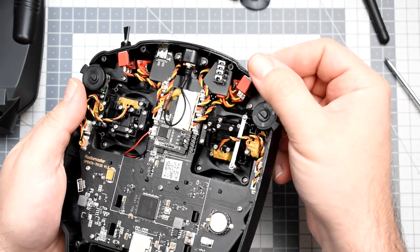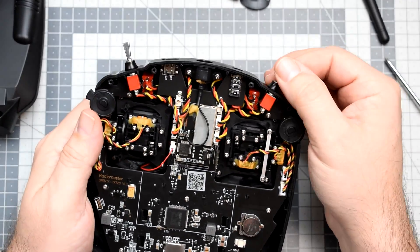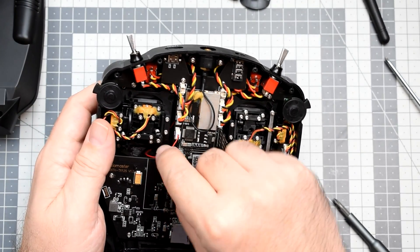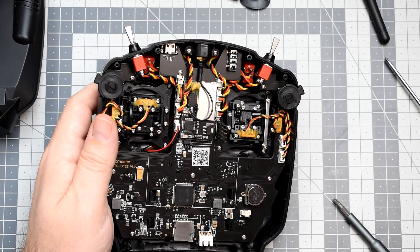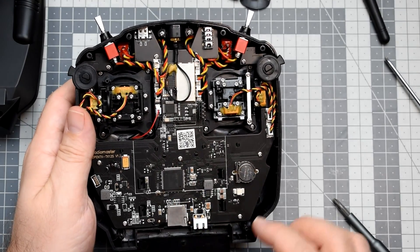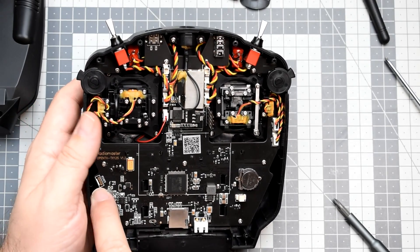The switches look fine — this really looks nice. There is nothing super wrong with them; they are held by nuts, which is also fine. The overall PCB quality is nice, everything is lacquered. However, there is no conformal coating on the CPU — it would be nice if someone could just smear some varnish on top of the electronics.